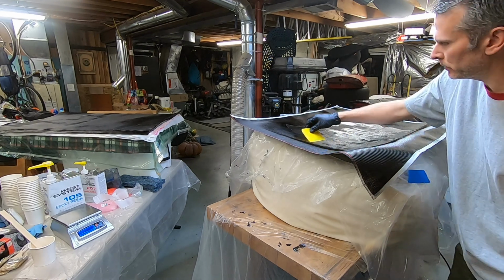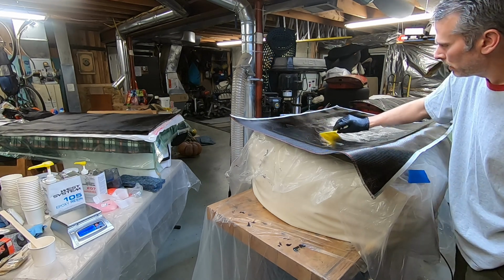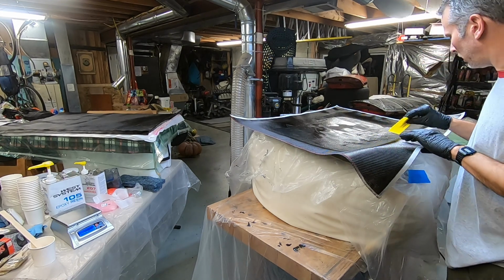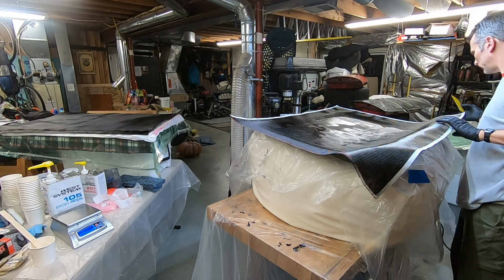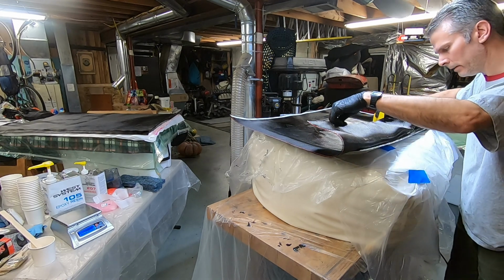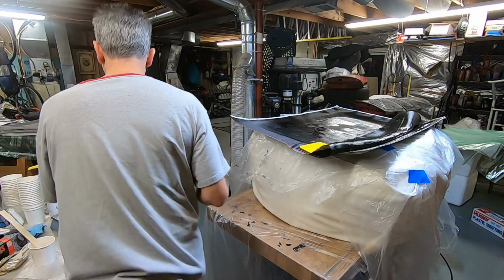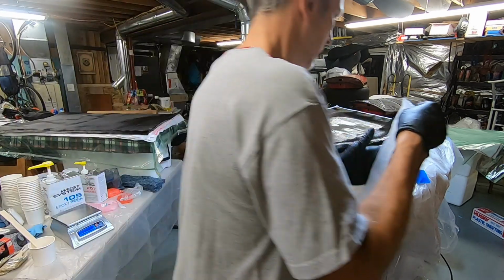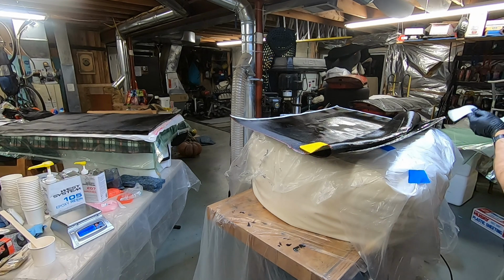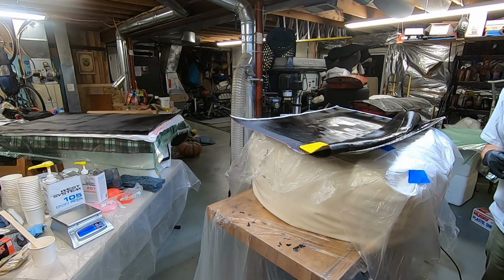Need to mix up some more epoxy just to make it a drenching coat. I did forget to put that fiberglass strip in here. I'm a little concerned about the carbon fiber pressing through the base coat, even though I've let it harden somewhat,